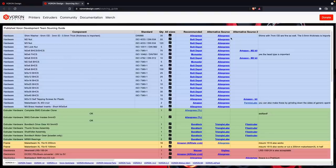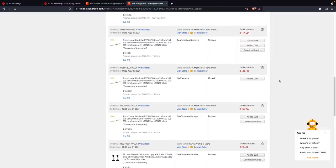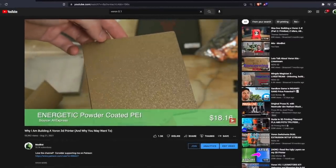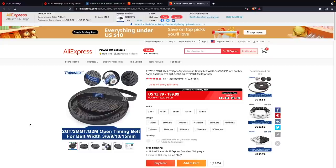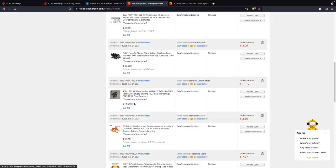I hopped over to the official BOM on Voron's website and had set aside a pretty good budget, so I was able to order quality components for the most part. I allowed myself to get a lot of spares, especially on things like the different hardware — especially like the M2 screws, because I knew I was going to strip them. Even with my budget and research, I ended up accidentally ordering some really cheap belts that I ended up having to get swapped out because they were deteriorating very quickly, as well as an incorrect number of bearings, which basically led me to put the build off to the side and wait an additional two weeks for my next shipment to show up from AliExpress.